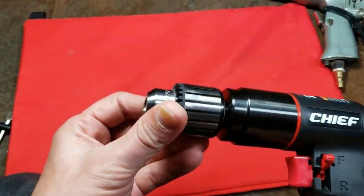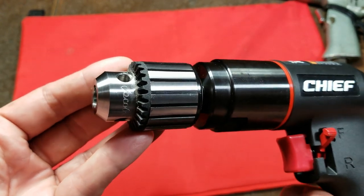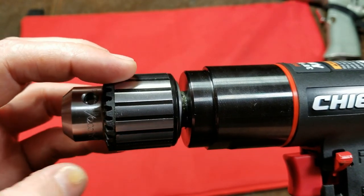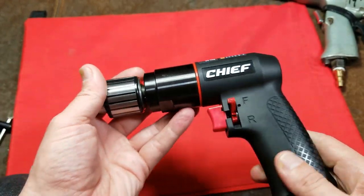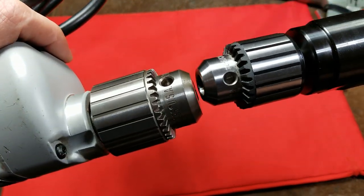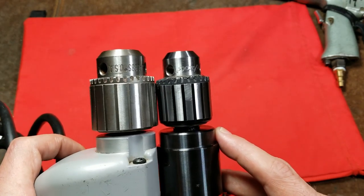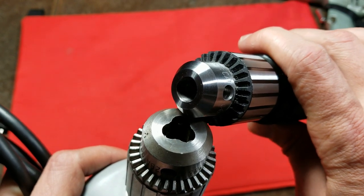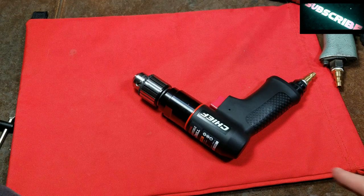They have all over the box 'Jacobs industrial chuck,' and this is indeed a genuine Jacobs chuck — I'm pretty surprised about that. It's a standard professional-grade chuck using premium billet steel, not a stamped sheet metal collar. However, comparing it to an actual Jacobs industrial-grade chuck, it becomes pretty obvious: the industrial-grade chuck is much larger with a heavier body featuring a lobular design that gives the teeth lots of extra lateral support. So they're throwing around 'industrial' a little too liberally.